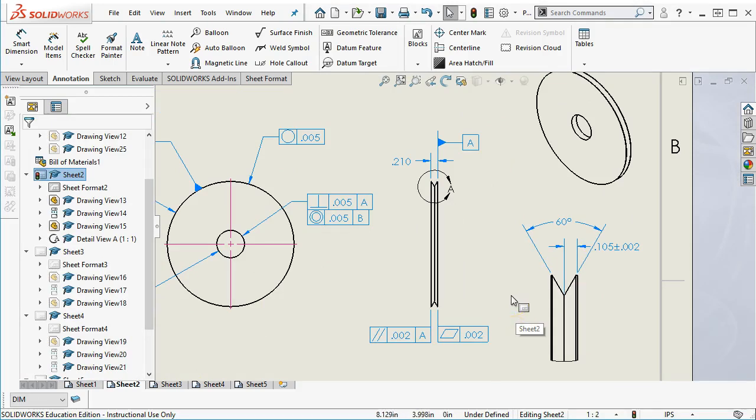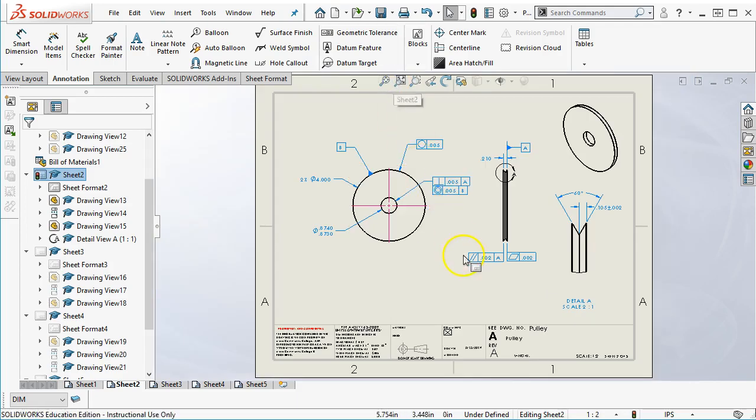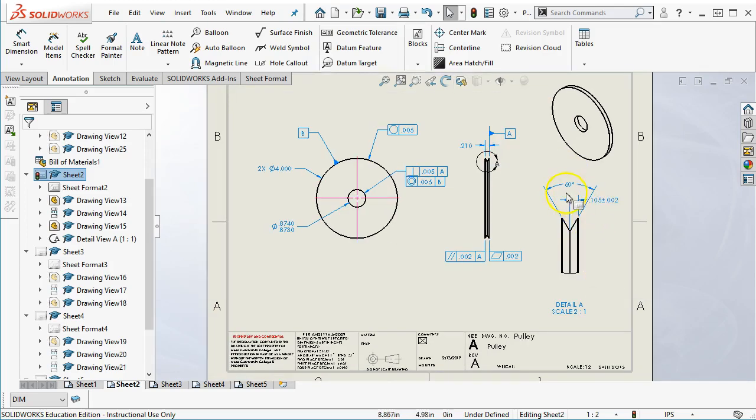And so, from a GD&T standpoint, you know, position, the angularity, I could use it, but the question becomes: is it adding value? Is it something that I need for this part? And right now, the answer is no. All right, so this will give me a tolerance that I can inspect to, that I can measure to, the 60 degrees.